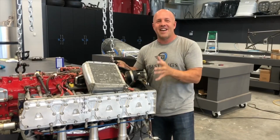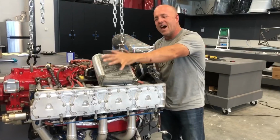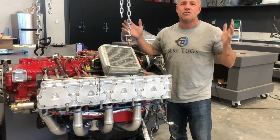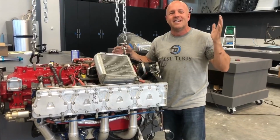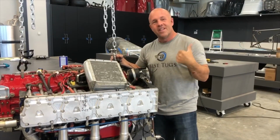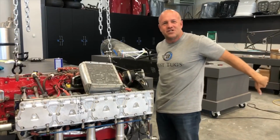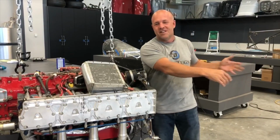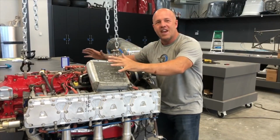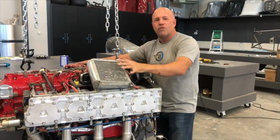It's going to overheat like crazy if I have oil coolers sucking that volume for this oil cooler and this oil cooler. It doesn't work. I'm going to have an overheated Cub. So two things. Oil coolers are gone. They're going to actually help my weight and balance. They're going to go right behind the passenger seat with two side scoops. That moves my weight back. It helps me get the airflow that used to feed two oil coolers here, now all going through the